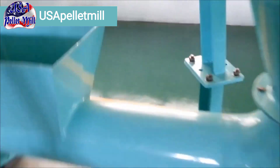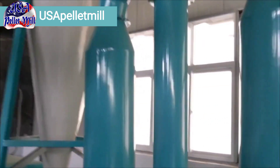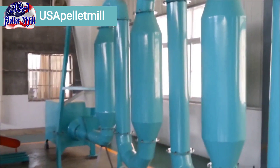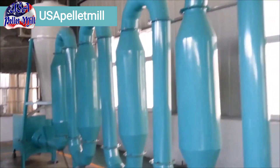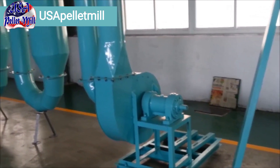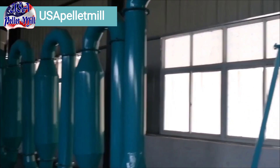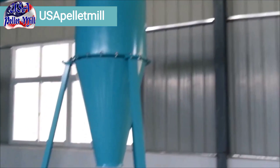The dryer now has the heat — as you saw, the furnace heat is getting sucked through the drying system. It's going to run through all these chambers. These tubes here are going to transport the material — let's say sawdust or hammer milled products, whatever it may be. Here's a fan; it shows that it's going to suck the material through and as it does so it's sucking the heat through as well. This is called the flash dryer. It'll bring that moisture down to the adequate amount, around that 12 to 16 percent range.